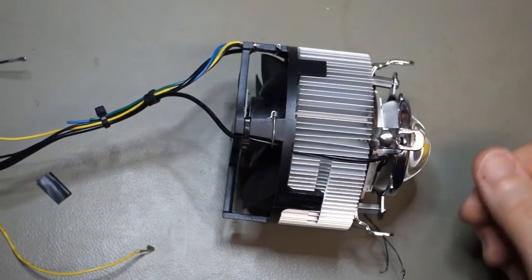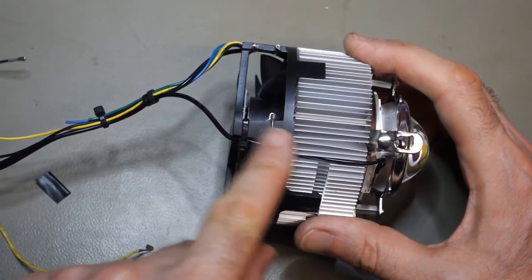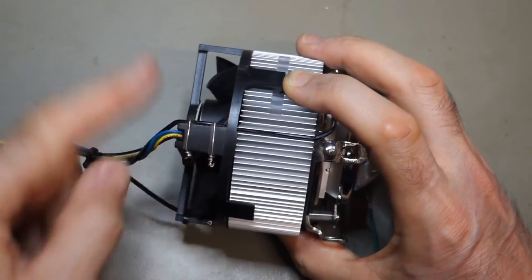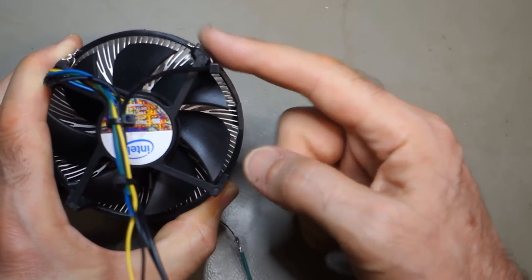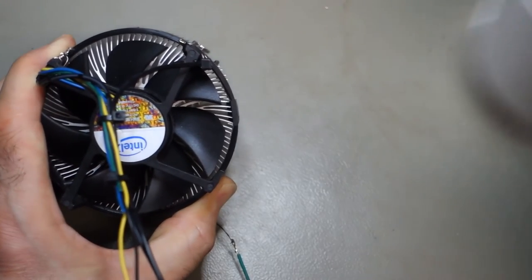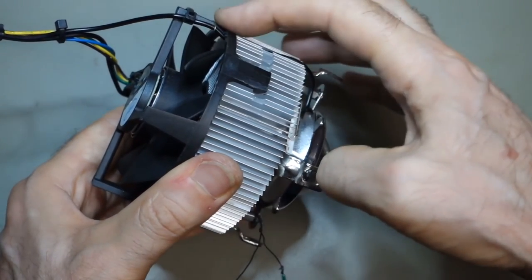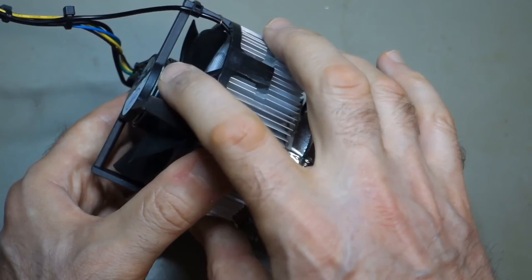Right. Just as a little aside, I've decided to swap this tie wrap here for a metal tie, and actually to put two in. I've done the two on this leg, if you can see. And I just filed a little groove in the plastic there so that the metal won't slide up and down. The reason I've done that is because looking on the end, this was just protruding into the tube and it was making it very hard to get the assembly in and out. It should really just slip in nicely. And also, I don't know whether you can see this on the camera, the blades do run fairly close, and I was worried that the clip down here might actually interfere with the blade, so a thinner piece of wire I think is a more practical solution.